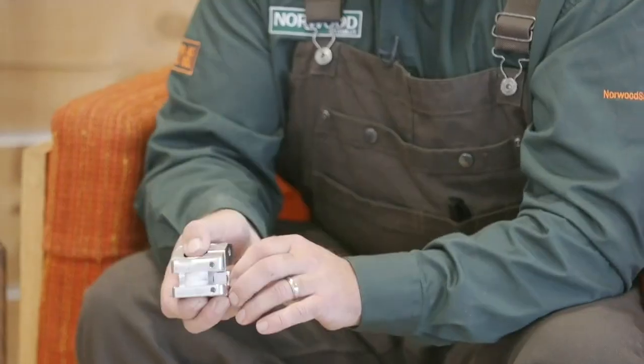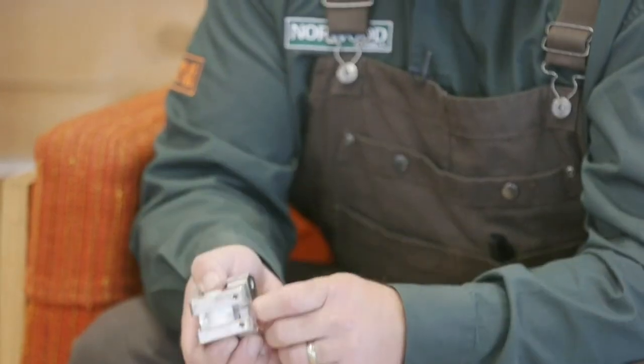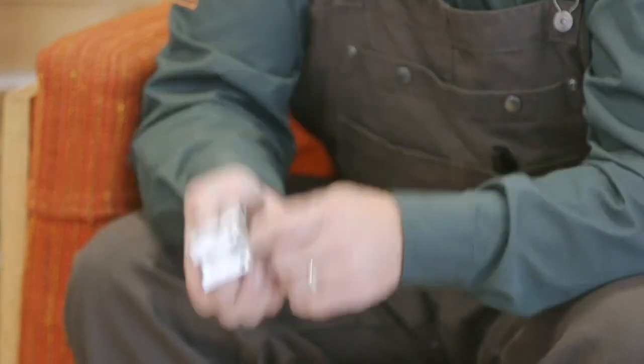The benefits of the ceramic retrofit: it lessens deflection on the blade by trapping it from going down as well as up, giving you better results on your cuts and stopping it from wandering. If you're cutting with the throat wide open, this will help. Roller guides create a little more friction and heat because it's metal on metal. Ceramic is a natural heat absorber — it'll actually pull heat from your blade better. This ceramic is reportedly the same material used on the outside of the space shuttle. If you want to dial up tighter results on a piece of walnut or anything precious, this will help.